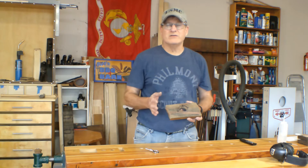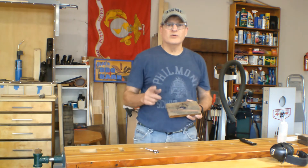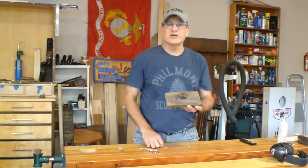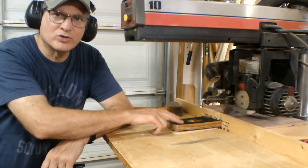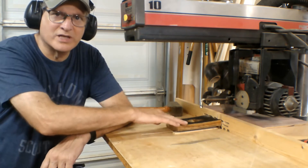I did cut off eight, eight and a half inches that I've reserved for another project — I'm going to be making a whiskey smoker. So let's take this over to the saw and start cutting. Anytime you're working with barrel staves or those kind of parts and they rock, make sure they're appropriately stabilized. Don't try any cuts unless the part is stabilized.